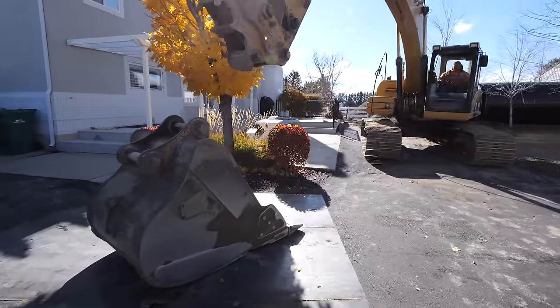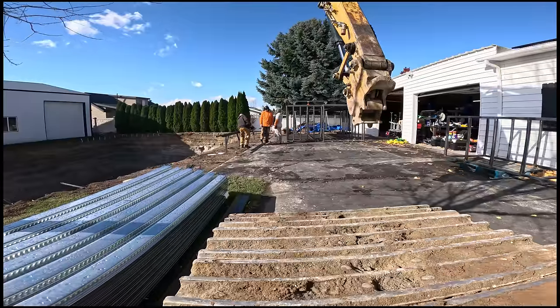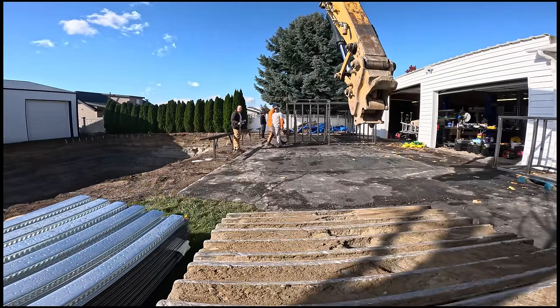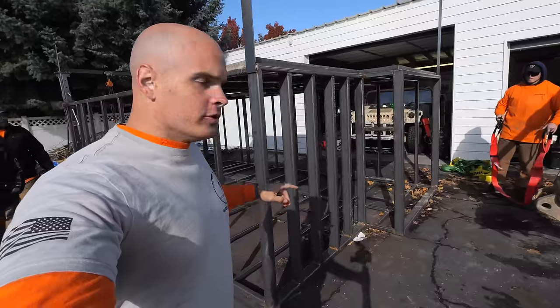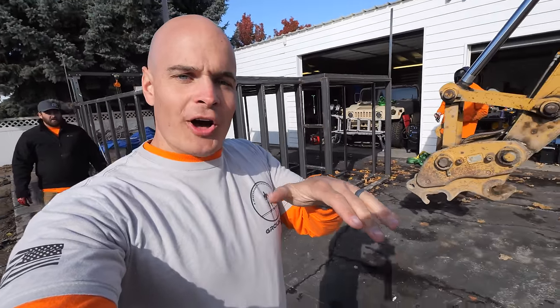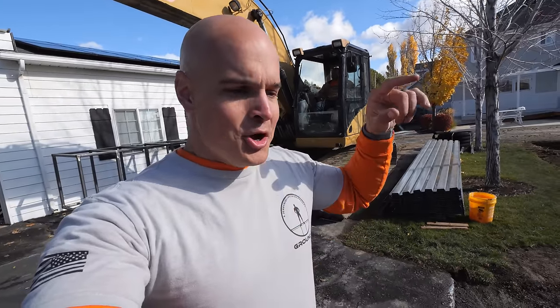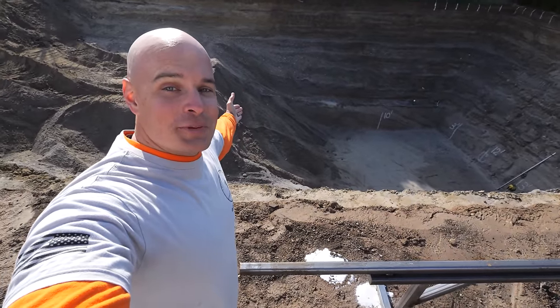One cool thing about excavators is not only are they good at moving dirt and digging holes, but they can also act as cranes, which we need since our shaft is currently horizontal, and it needs to be vertical before the B-decking can get attached to the sides. So far, we've been welding the entry shaft on its side. Now we're gonna use the excavator to tip it upright so we can finish putting the B-decking on the sides, which will keep it waterproof down in this hole, which has magically appeared.